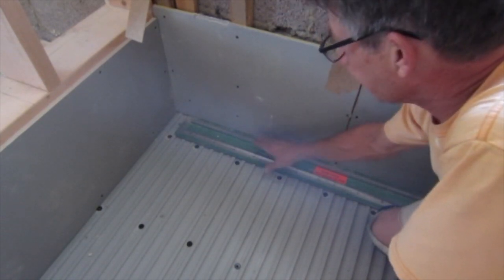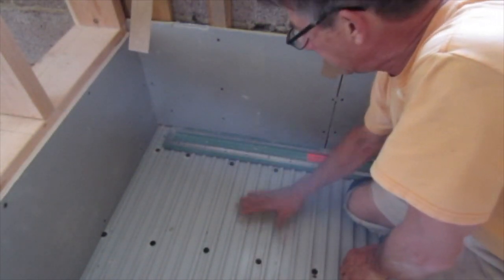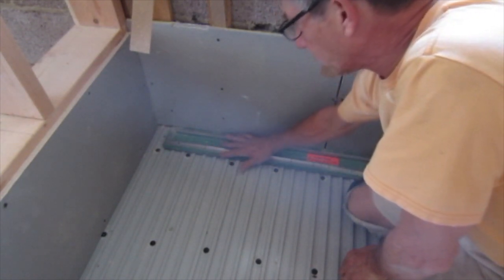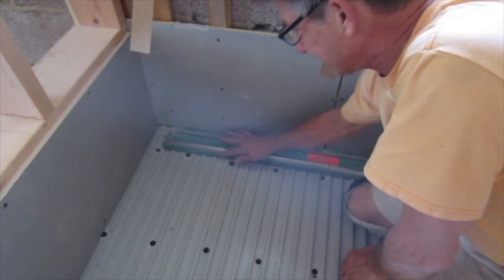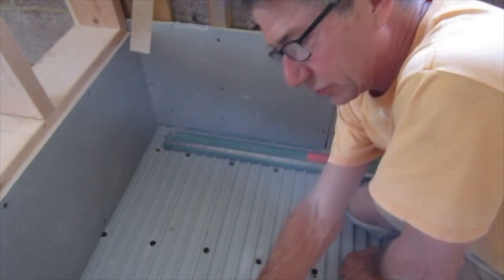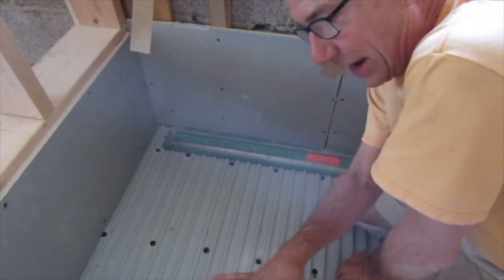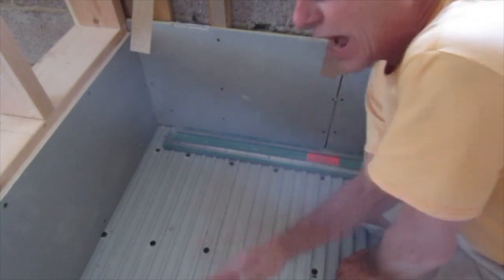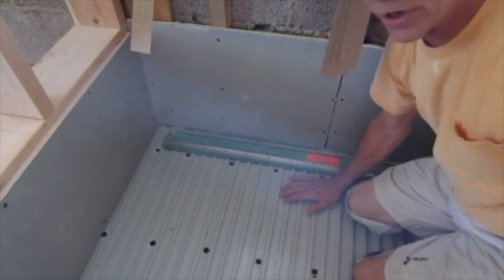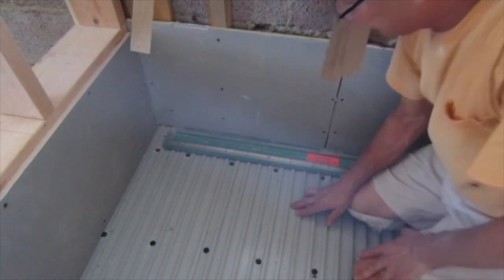It's not a big deal. So I also wanted to say, before you do your mud base in here, you want to pull this clamping collar off. Leave all of your green protective plastic covers on here, and you're going to screed from the top of the drain over to your subfloor. I'm going to put a piece of quarter inch backer where the shower is going to end, and screed to that, knowing that I'm putting a quarter inch backerboard all over the floor. That's the height of the tile as it continues across.